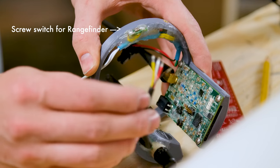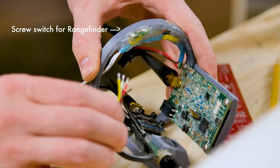I'm personally not sold on the reliability of screw switches under high vibration environments, but they're good enough for this. I also put a screw switch on the power bus for the USC RPL rangefinder, which was one of the payloads we flew on Lumineer. The idea was that early on in development we weren't sure exactly how much current the rangefinder was going to draw, so if we had to idle on the pad for three hours, we wanted to be able to minimize that.